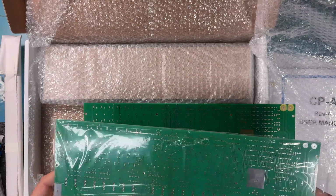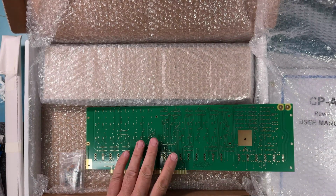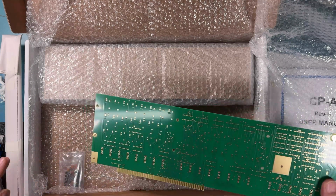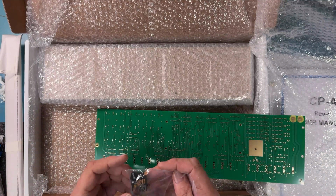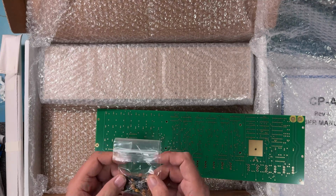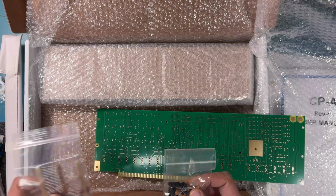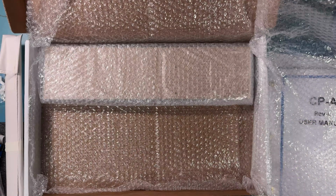So Robert just packed this board in there just so there was a board in there. Like I say, this is the board we're going to actually assemble here. Like I said, this is a final evaluation, and we knew the board would need to be swapped. There's a second kit here with the heatsink, voltage regulator, and all the 0.1 microfarad caps and the tantalum caps. And this way, the sea of 0.1 microfarad decoupling caps are separated from the 3 special caps that are in here. So we have our board we're going to work with here.